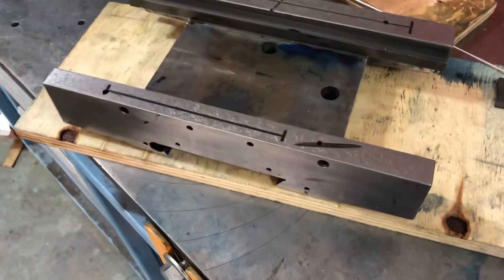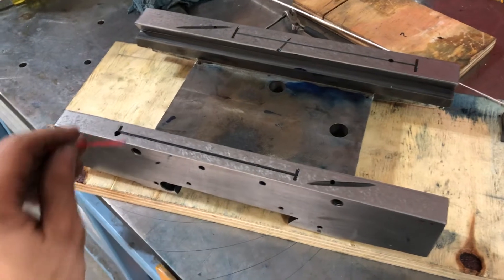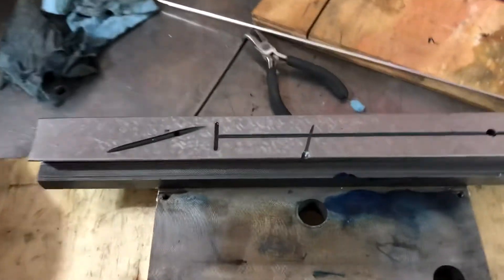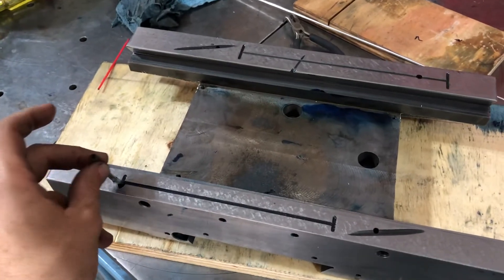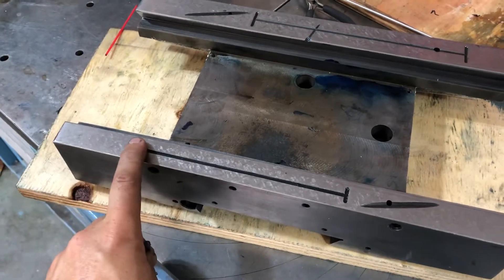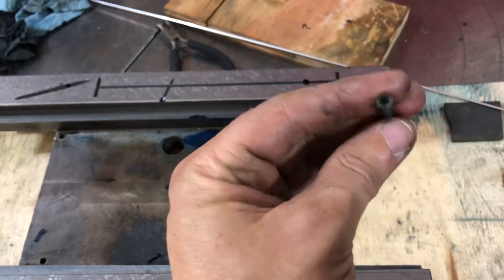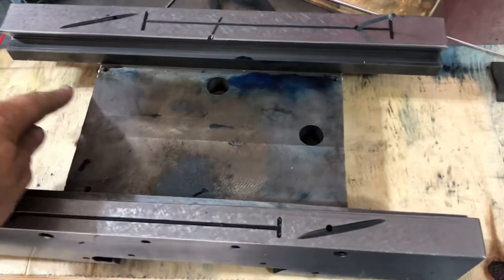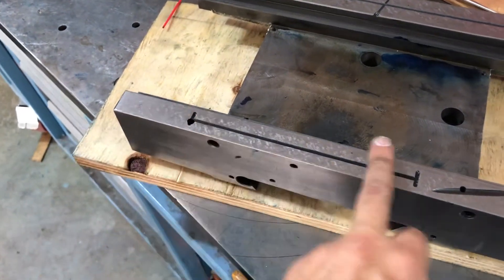I'm taking a look at the so-called one-shot oiler. We can see here that it does have these oil grooves. Originally what it had — where are they? — it had these little plastic tubes in there. It had one here on this side and one there. I basically just cut them off because they were sort of munched up. They went there and then around here, with a one-shot oiler pump right about there. That takes care of the top ways.